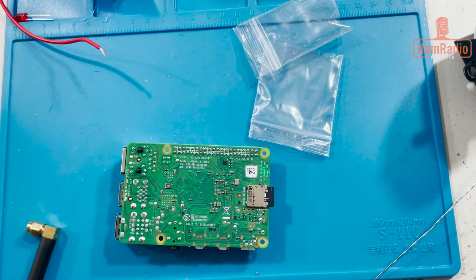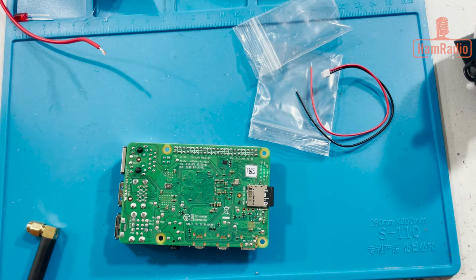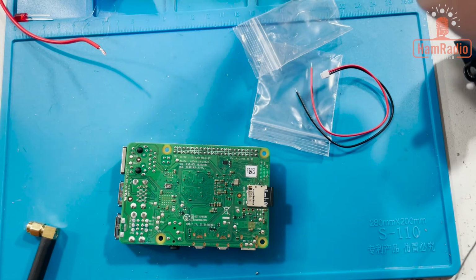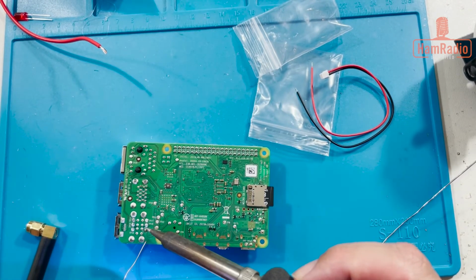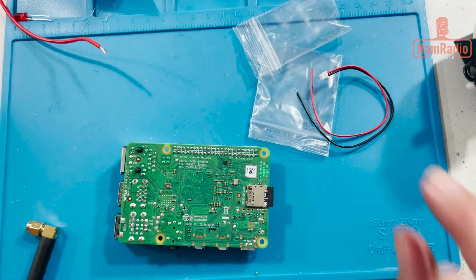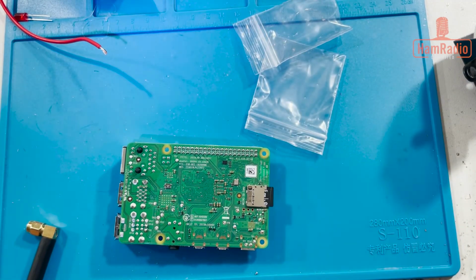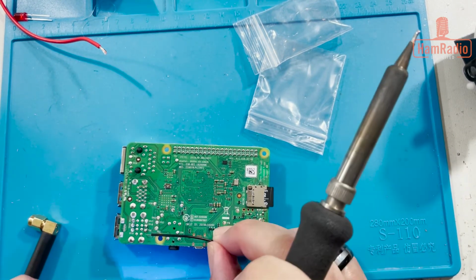Okay, for this SHARI install, this may be the scariest thing for some people. I'm making sure I'm doing it right there. You got to solder this on to black on the TP6 and red on the TP10, which is right here on the Raspberry Pi. So I think I'm going to try to prepare myself a little bit ahead of time here by maybe adding some additional solder, because when I get down here to do this, I don't want to spend a lot of time on these. TP6, TP10. All right, so black goes to 6, so we will solder 6 or black to 6 right here.